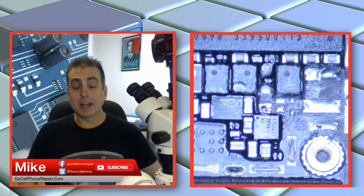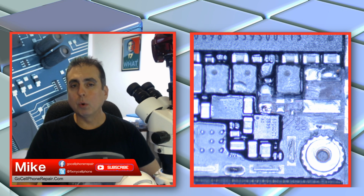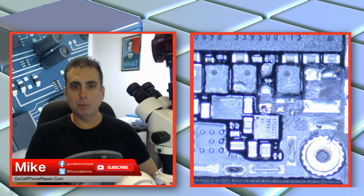But, and I already replaced the capacitor. That was the easy one, obviously. My plan was to work from the inside out, and I wanted to put the big coil on last, so that way I have a lot of clearance to reach in there. But I'm wondering if it would work without the glass diode. And I would think that one would be pretty easy to install with lower temperature hot air, hopefully.